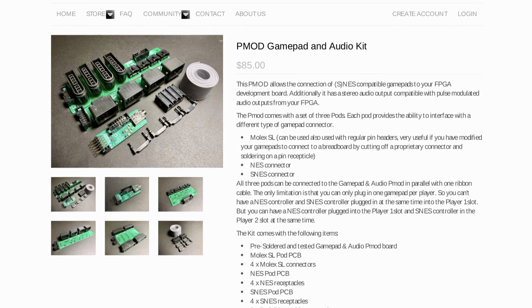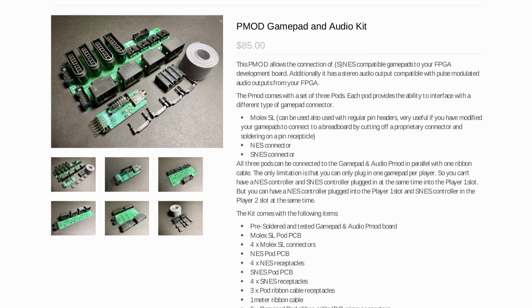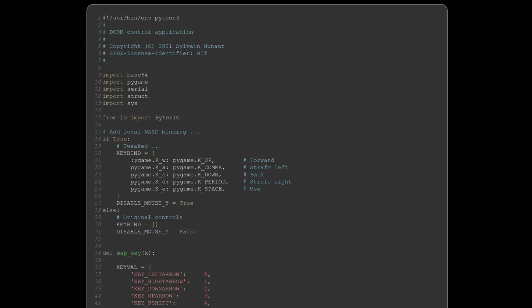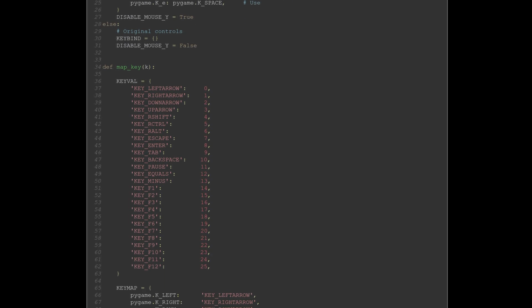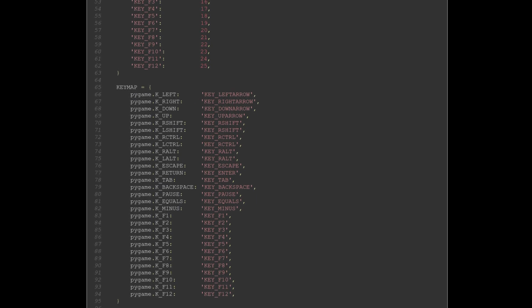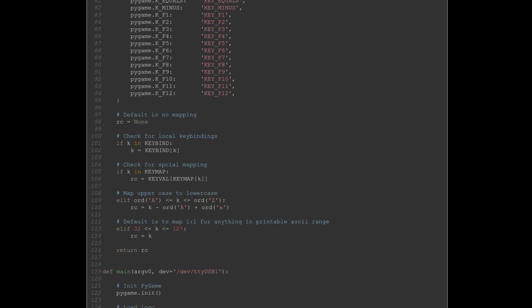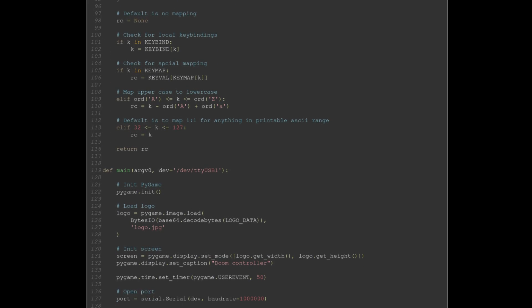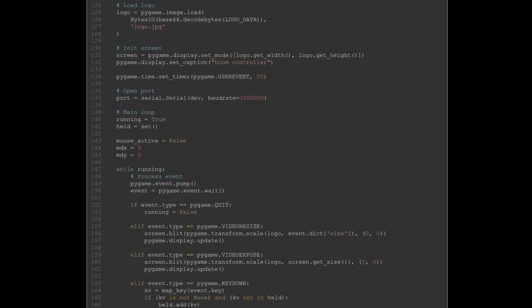So when I was working on this project, I wanted it done right now, so I went with something I could do with what I had on hand. The solution I'm using is to feed user input through the serial port provided by the FTDI from the host machine. At first, it was rather crude, just feeding characters with a terminal emulator, Minicom. It's really not good, though, because for gaming, you really want to send key down and key up events to support keys being held down for some time and multiple of them at the same time.